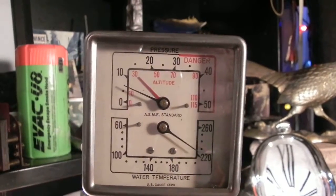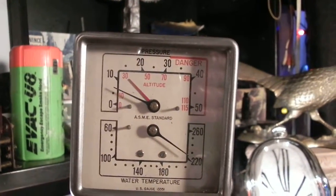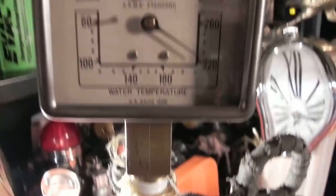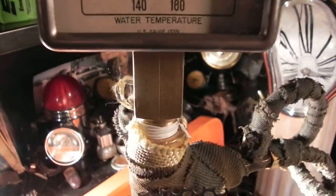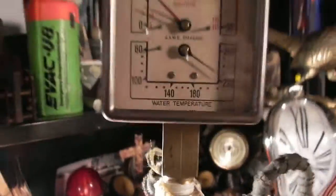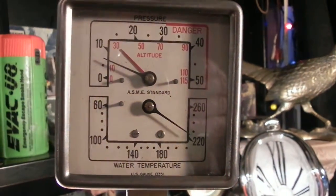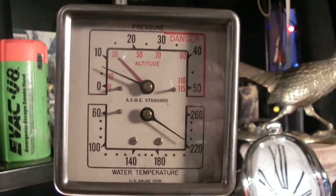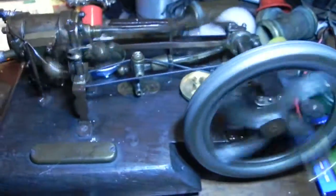We've got the Dorge motor running as a bleeder valve, and this is running right into the neck where we fill, or we used to fill up the tank. We now fill up the tank with the actual pump. But there you go, that's the temperature of the steam at the head, 220 degrees Fahrenheit. Pressure is just about 7 psi. Got the Dorge motor running quite smoothly here.